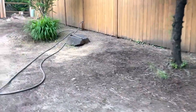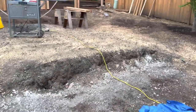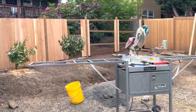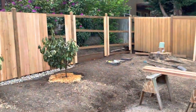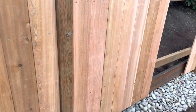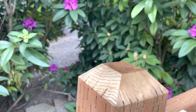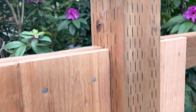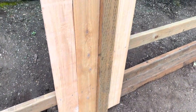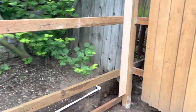Let's take a look at the project. You remember the big piles of rock? The rock walls are out, the rock is all gone, and that monster tree in the corner is gone. This is the setup where I'm building my fence. Building prices have gone up. I explained the chamfer detail on the top — let's look at the top of a post. That detail I make on my radial arm saw. It's a 4x4, pressure treated, 8 foot — 6 feet above the ground, 2 feet in the ground — with 2 bags of Sacrete concrete, 60 pounds each, so 120 pounds of concrete at each post.